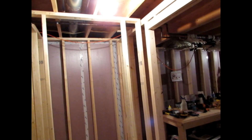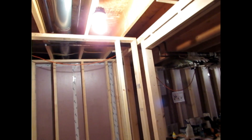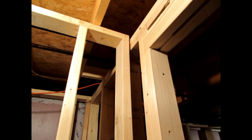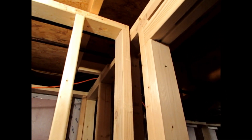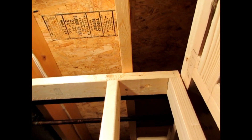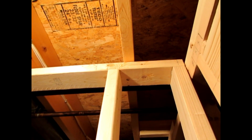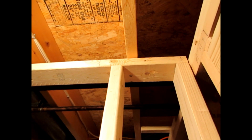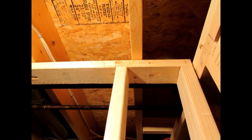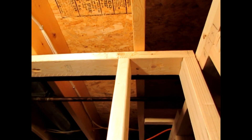For this wall now I'm going to address this a little bit differently. Since my top plate is going right across my two joists on the top, we're going to level this wall here both ways, and then I'm going to shoot a nail right with my pneumatic nailer into the joist up above, straight up and down, so it gives it a little room to expand — a little thermal expansion over time — and it's going to fix this wall in place with the joists on the top of the wall.